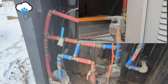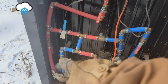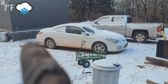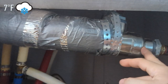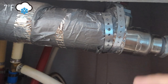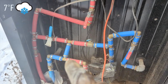Whenever the house is not calling for heat, the water bypasses the air heat exchanger and comes right back up to this point. So that valve is open and the water goes down to the big house, through both heat exchangers — the air heat exchanger and the hot water heat exchanger, which is the heat exchanger between the boiler loop and our domestic hot water loop.